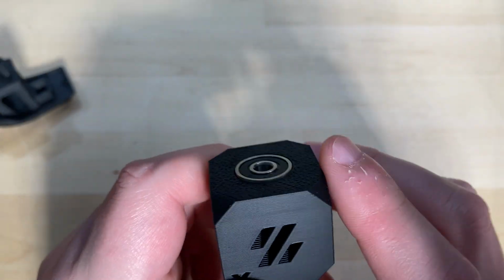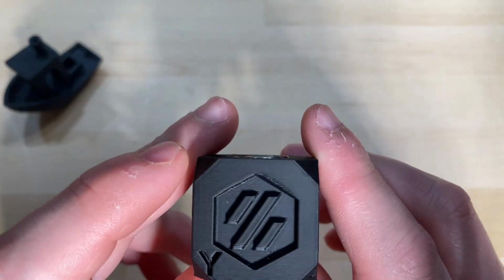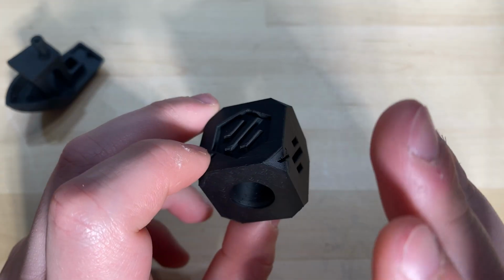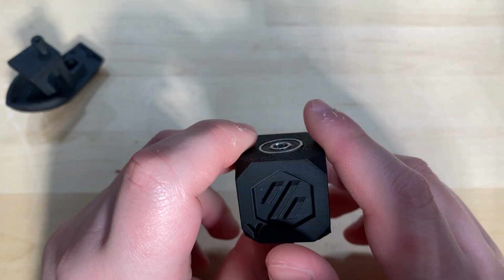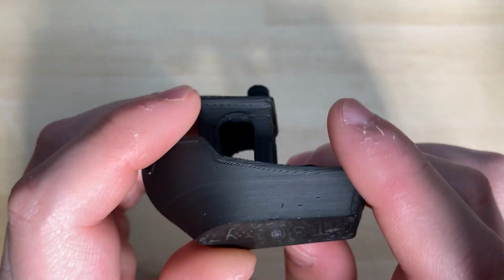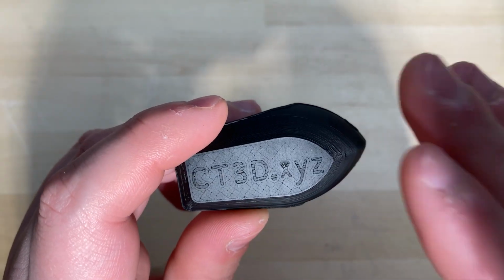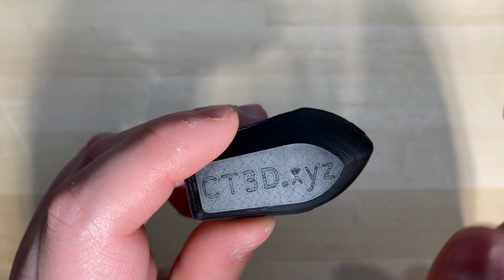Anyway, there are some problems with the Benchy which I will show later, but the test cube printed pretty good. I didn't start pushing speeds just yet, so there is that. As I increase speeds, it'll get even worse. I'm getting better at the probe calibration too. I think the main problem is the inconsistency from the probe readings at the moment.